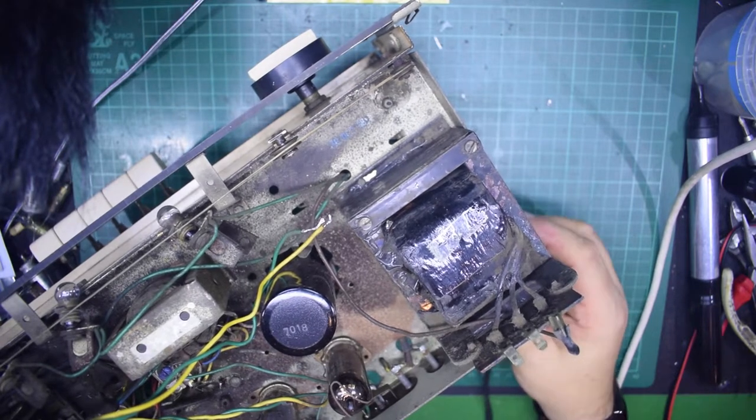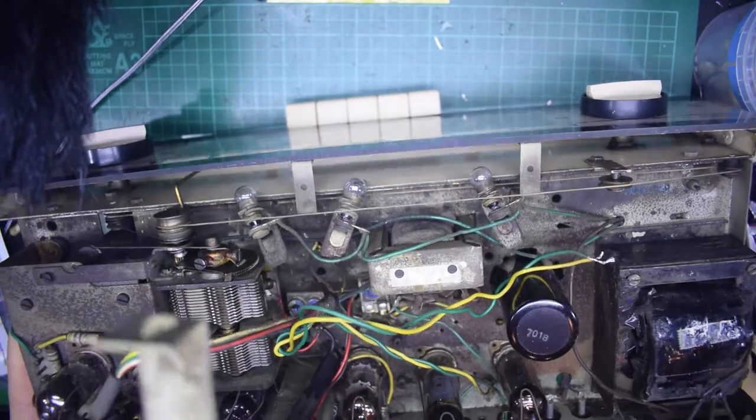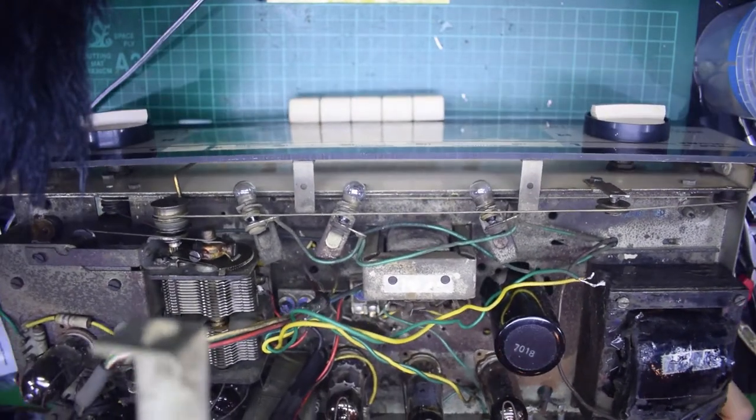Generally speaking, as far as repairs and restorations go, it's been fairly straightforward — I'd like to say it's been easy, but that would be a bit of a lie. Obviously the problem is getting spare parts these days. Capacitors have changed in size. Resistors that I've measured have all been fairly close to tolerance, but capacitors — not so much, they've been all over the place.